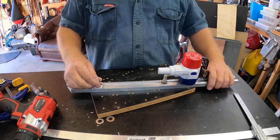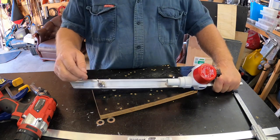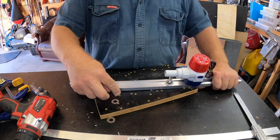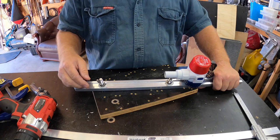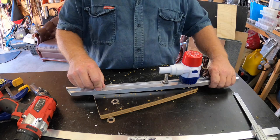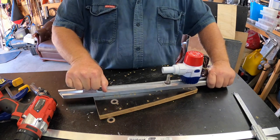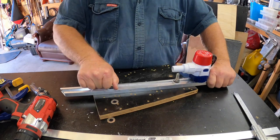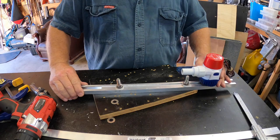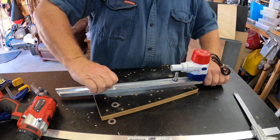So that's it done. They're M10s, so 10mm bolts, 10mm drill hole obviously and the bolt straight through. I couldn't put the stainless steel washer behind the bolt head because it just didn't fit in here. It's quite a tight fit, which is really good. That's loose and it's not difficult to move but hard enough that it takes a lot to move it - it's not just slippery slidey all over the place. And these tighten up really well with the nylon washers.